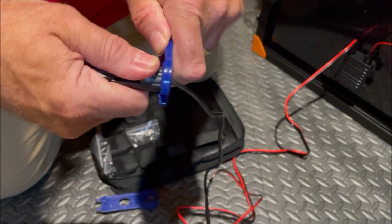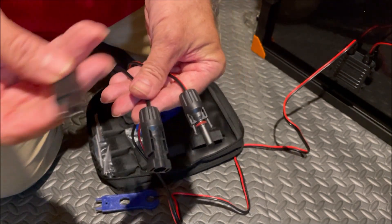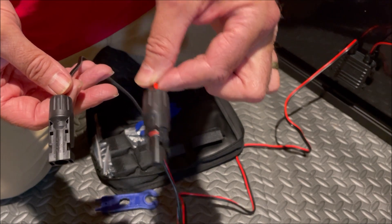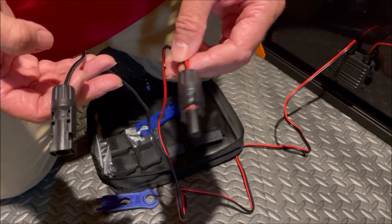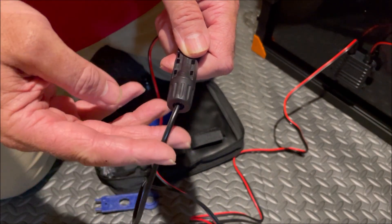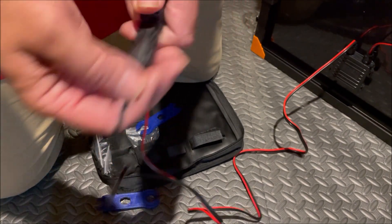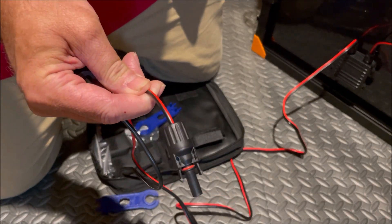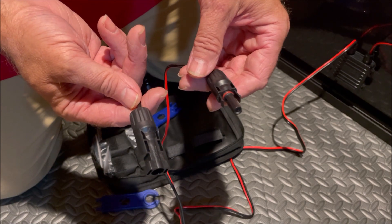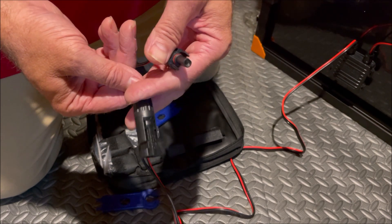Now we know it's tight and we have switched from an SAE connector to MC4. Remember, the important thing is the source voltage hot always has to be the male connector. When you hook it up to an extension cord, the red wire on your extension will have the female connector, but at the end of that extension line, that'll be your hot and there'll be another male. Thanks YouTube — this was a viewer request. Hope you enjoyed the video, make sure you like, subscribe, and hit the notification button for new videos. Bye-bye.